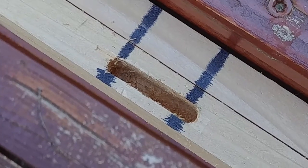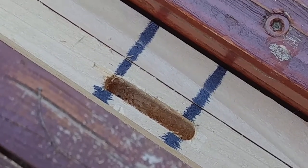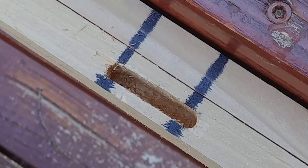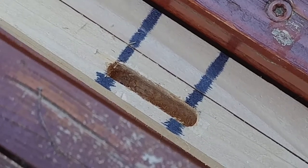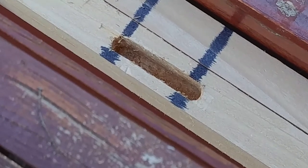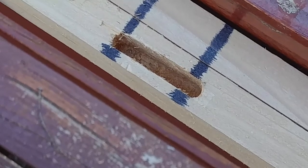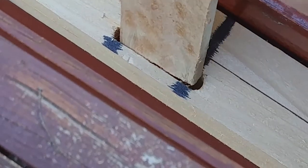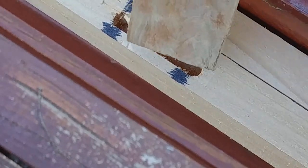So you can see that on my first one, it ended up slightly off center, so I'll readjust again for the next one. It's also longer than my line spacing, which was an inch. In any case, I'm using the deck beams I ordered from Brian, and they are larger than this, so I had to make the mortise larger because I tested the deck beam in it and it needed that extra space.